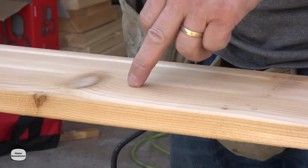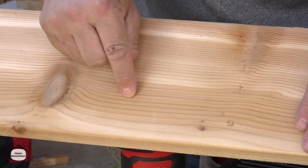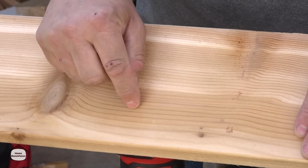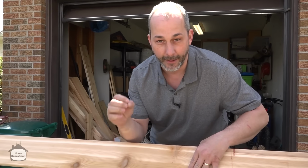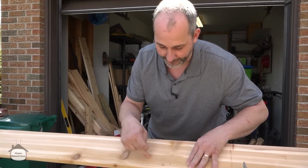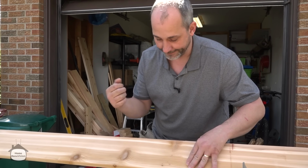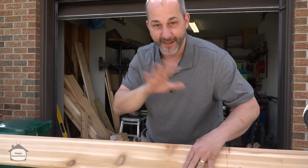You can see in the grooves here, okay? You've got these lines and then a space. Each of these are a different material, okay? So the lines are actually a much denser, tougher material. And so when you're sanding, you'll sand that soft spot, and because of the different densities, you're actually causing a little bit of a scoop. You don't even see it.